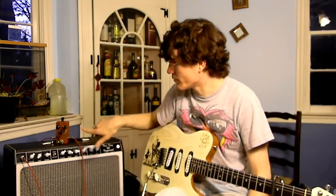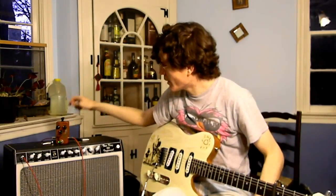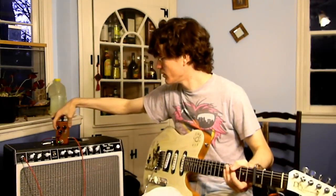I'll put a little note in, but this particular sound is something that I think is unique to a PT2399 delay chip. When I was designing this, since I wasn't going for the sound of a tape delay or an analog delay or anything like that, I was looking for something to really bring out of this particular delay chip. And this kind of bell-singing sound is what I really wanted to get. There are other delays that have a little bit of this, but I just started removing a bunch of filtering until I could get a much clearer example of it. This is one thing I really wanted to bring out of the delay chip — it'll do that when oscillating to build a sort of pitch-shifted pad behind the repeats.